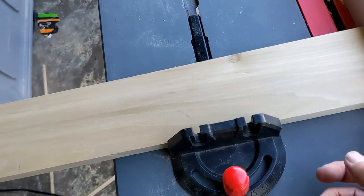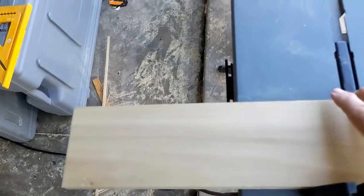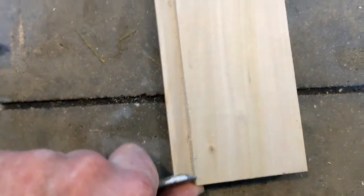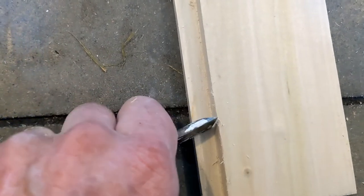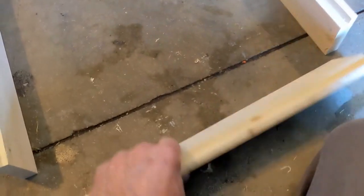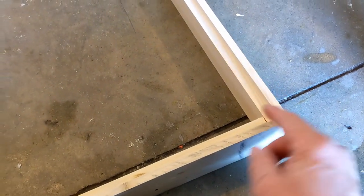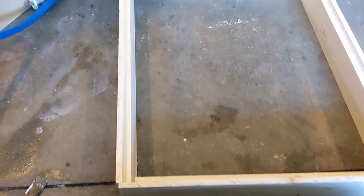I will raise the blade and make the cut while they're standing up, which is a little tougher, so I'll have to make a jig to do that. To pull off that little bit of ledge that I was saying when we cut in that way, I just run my chisel along. You can see a little splinter coming off. And that got rid of that little bump that's when the two blades are overlapping. It's not the perfect way to make them, obviously — that's just something. And you can see how this drawer is setting up, with the fronts not having the indentations, and this is an inset for that strong plywood that I'm going to be using.